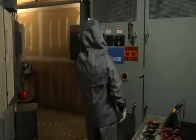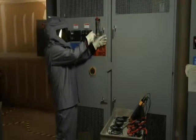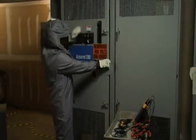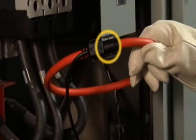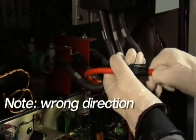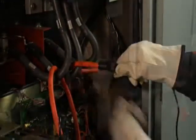Incorrect clamp directional orientation. After you've determined what equipment you need to monitor and gathered the appropriate PPE, put it on, and set up your barriers, make sure that you have all of your analyzer equipment set up and ready to go. If you're a qualified person, you can override those safety interlocks to open up that cabinet door — but safety first, always stand to the side when opening those doors. Then check your analyzer equipment, make sure all test leads are correctly labeled and color-coded. Look at the arrows on your current probes — they must always point towards the load. Match proper phases: phase A test lead to phase A, phase B to phase B, and so on, using color-coding to match the equipment.